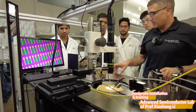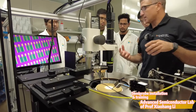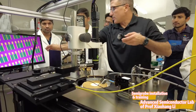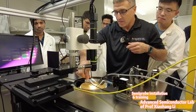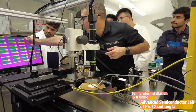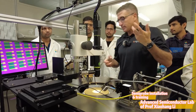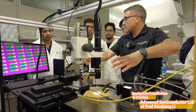Then here comes the platen. The platen is the area where you put all your probe needles or a probe card. If you have a probe card, sometimes people need more than four needles. So if you have your device and want to test all these pads at the same time, you can orient your device and put your needles accordingly to test everything because you need speed. In that case, instead of four manipulators, you need a probe card with multiple needles — it just goes down.